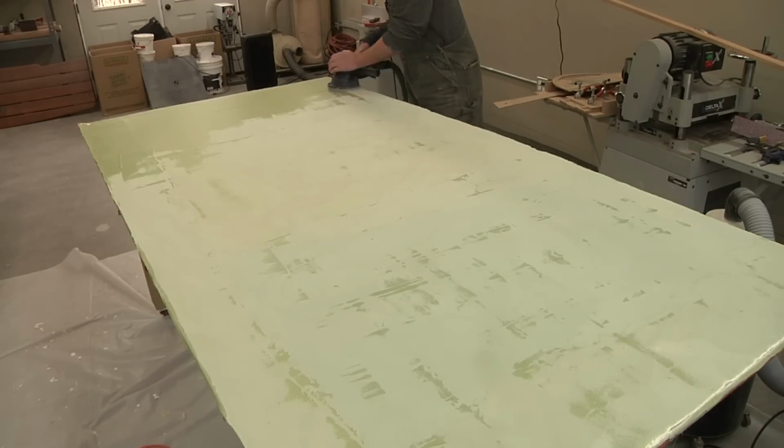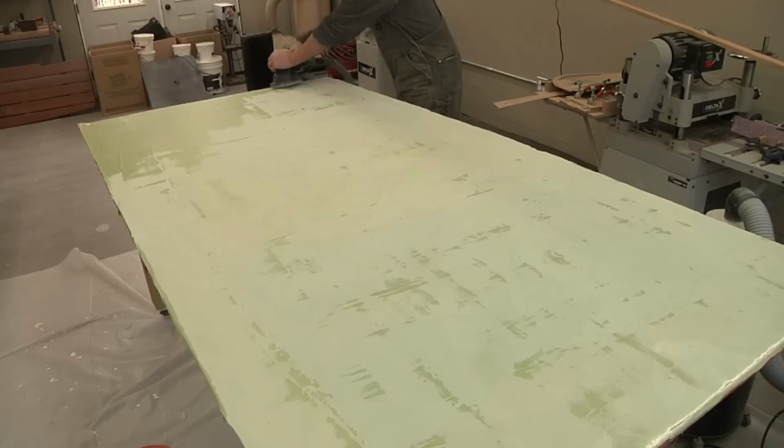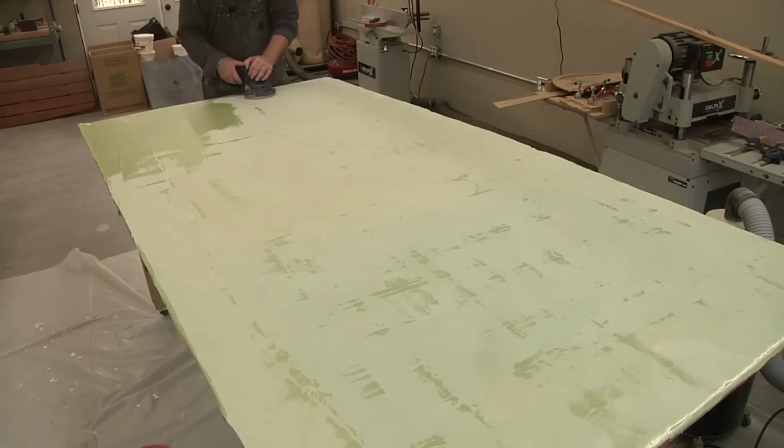And as is the case when you're working with fairing compound, you lay it up and then you sand it back. Now, if you notice here, I'm not sanding very aggressively. I'm just basically looking to knock down the high points. I'm trying to get this panel as flat as I can. I'm not going to bend over backwards and kill myself trying to do so, but I do want to make it as reasonably flat and smooth as I can.